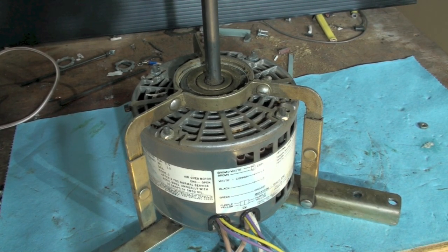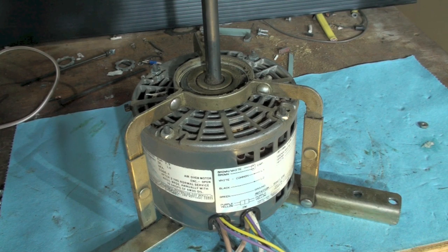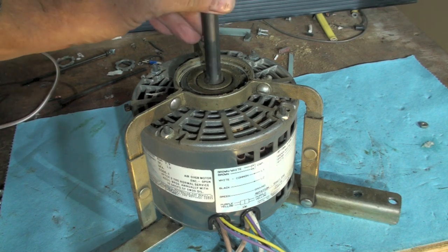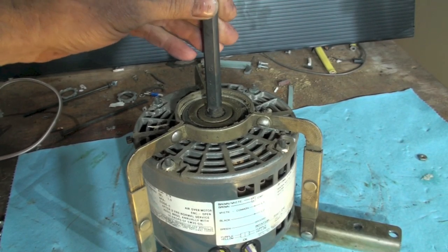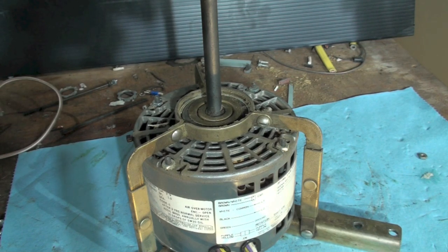In this one we're going to go over some of the starting characteristics of the PSC motor — that is permanent split capacitor motor. This is primarily the workhorse of all the fan type motors we deal with. If it's a fan motor, there's a fan mounted to the shaft and it's not a hard start torque motor — it doesn't need to be. These motors are designed for specific things. This one is designed to start a fan motor that has little resistance to rotation, so it uses a low starting torque.